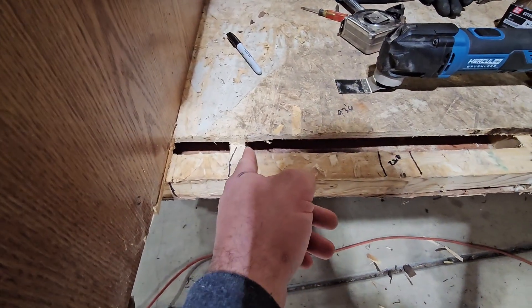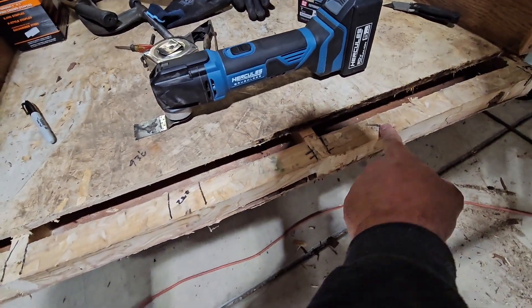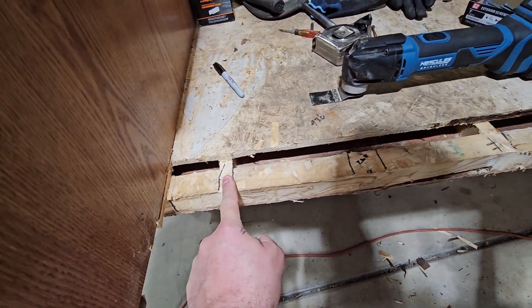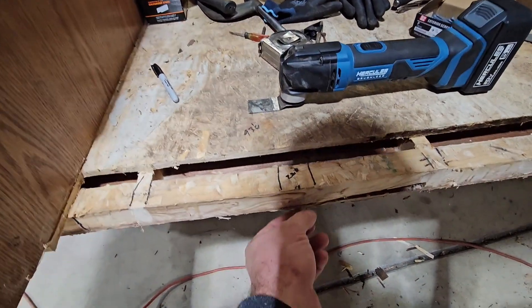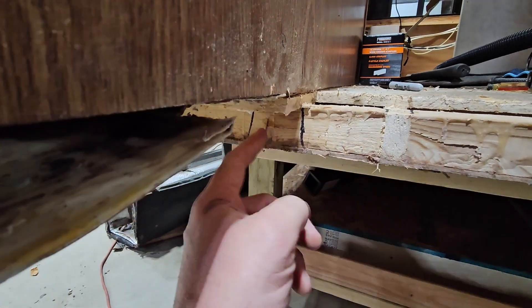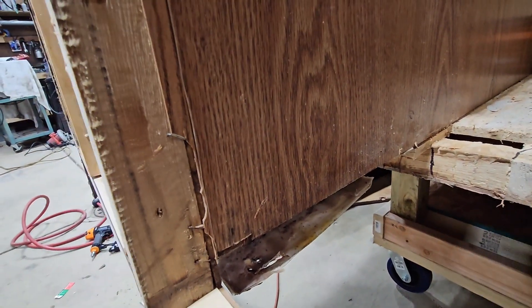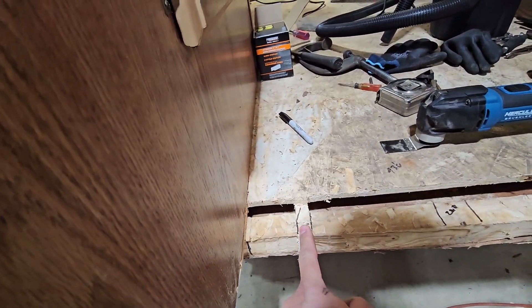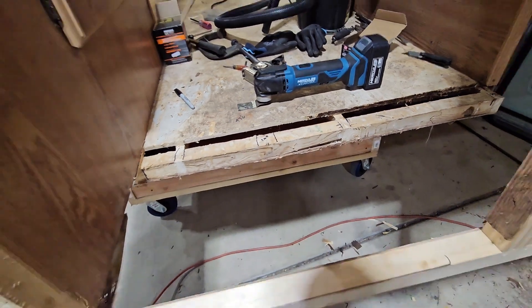What I'm going to do is cut these pieces of two by two, free them from the under-paneling and floor studs, shift them back underneath and do a half-and-half overlap so it's structurally solid. I'll cut this two by two to a point and put another two by two running underneath the patched area and under the wall, so that'll be solid. That'll leave a tab sticking out I can build off of on the side.